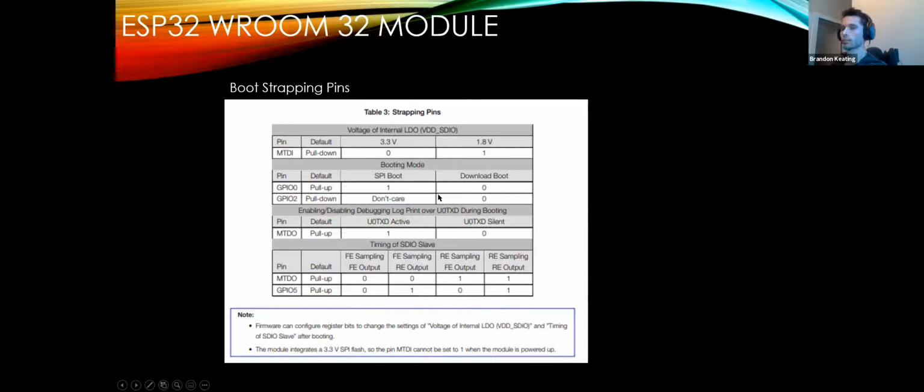And again, this is a really important thing with ESP32 specifically. There are plenty of other microcontrollers that don't require any sort of peripherals like this. The ATmega328 is pretty much a standalone chip that just doesn't need to be put in any sort of mode. You can pretty much just plug it in, program it, and start it, and it's good to go.